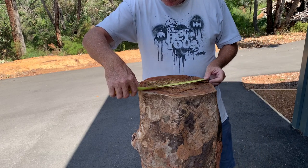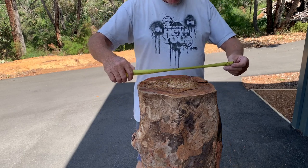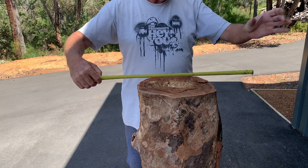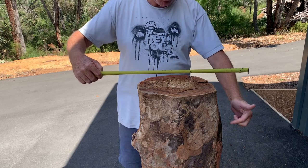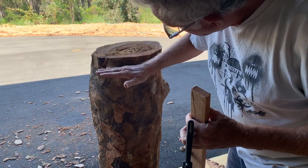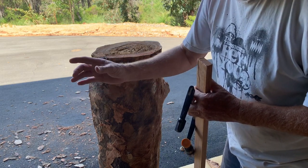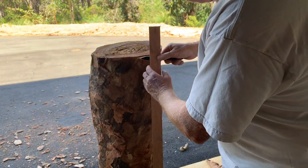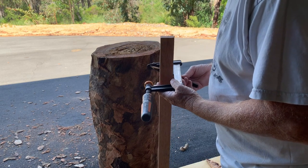The idea is that I make discs bigger than the diameter of this tree, which is about 340 millimeters. So if I make a disc say 500 or even 600mm wide, and then I have a piece of wood going across there and I attach my turbo plane to that — up and down — I should be able to get a nice radius. I want to make the top at right angles to the log before I cut, so I've propped it up until it's vertical, checked it with a plumb bob, and I'm just going to add a pencil line to make it accurate.